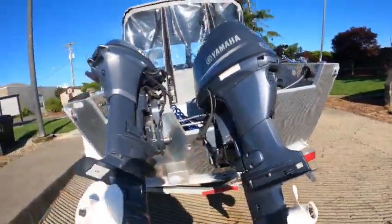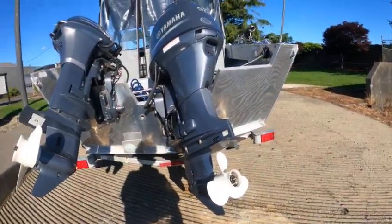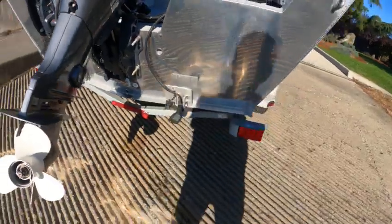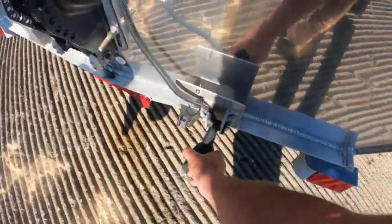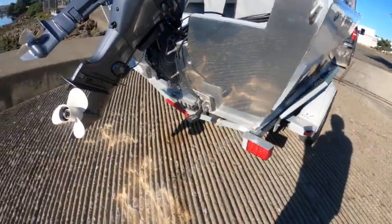These are total saltwater protected — stainless steel prop shaft, drive shaft. You've got two coats of clear, two coats of primer, zinc internally. That's an inline four, that's why this 50 has power. You've got the Lowrance HDS5 with the speed wheel. You don't see many running the water speed, but it gives you an accurate reading of how fast the water's moving.